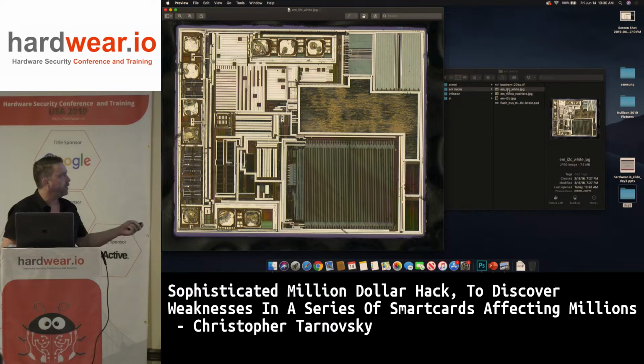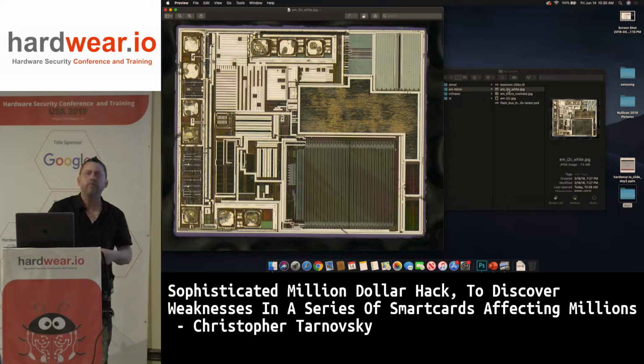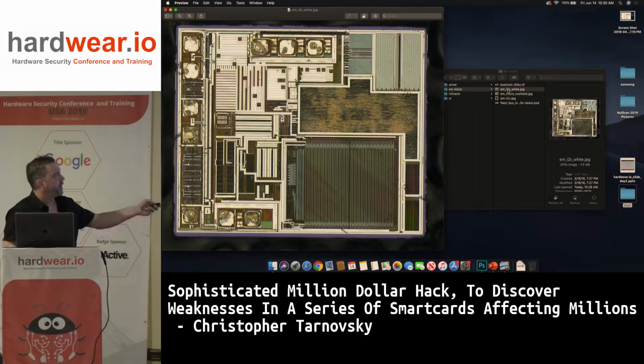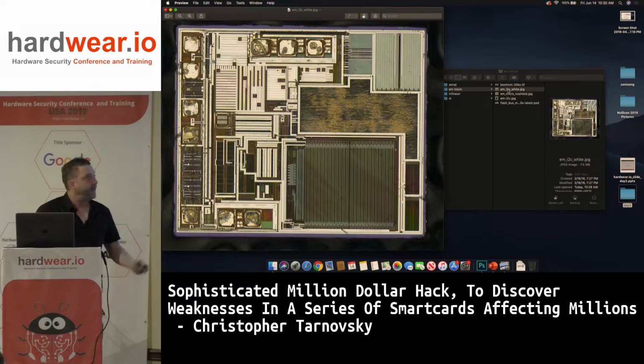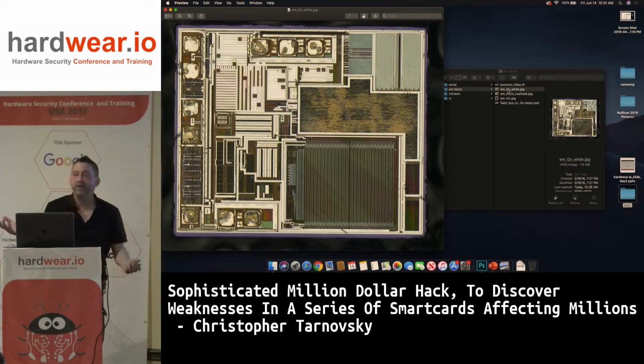This chip runs on its own internal frequency. All of these chips, except that Atmel, the first Atmel I showed you, run on the internal clock. So I think we strapped it, we found some instruction that jumped into flash, and the addressing on this was out of order too. But here's the easy way to figure out the addressing scheme.